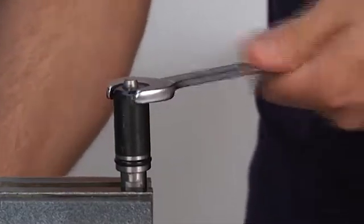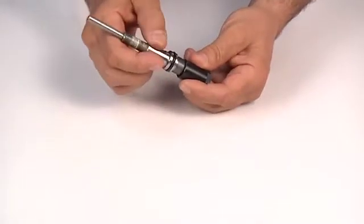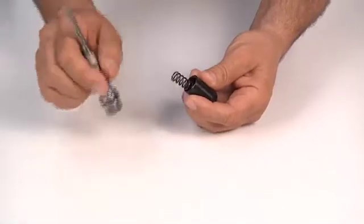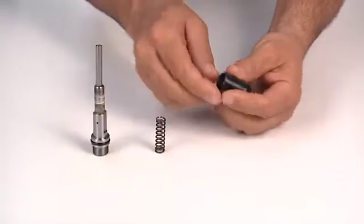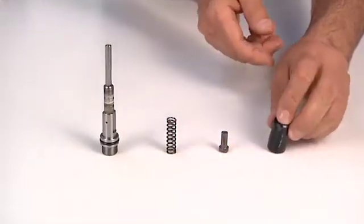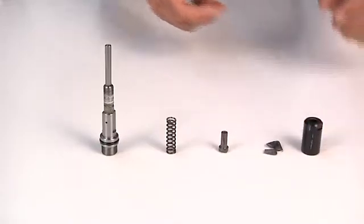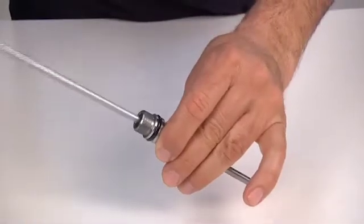Lock the cone holder in the clamp. Then, loosen and remove the clamp holder cone. Remove the spring, clamp opener, and clamps, in this order. Use a screwdriver to loosen and remove the suction cone.